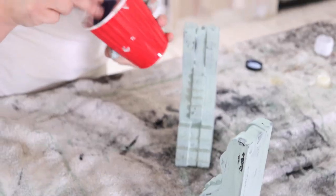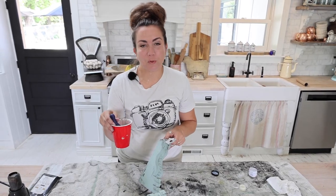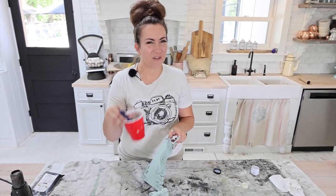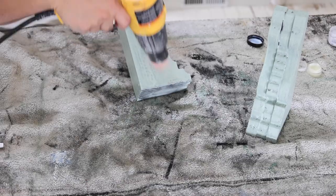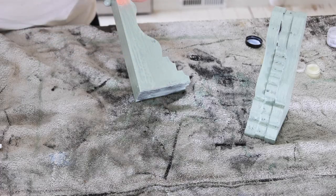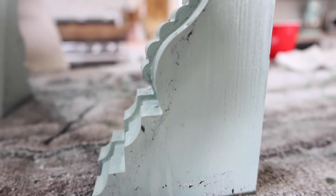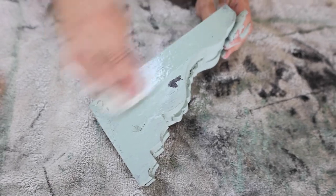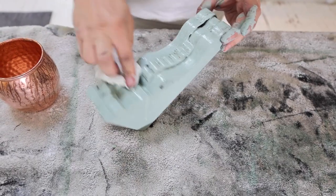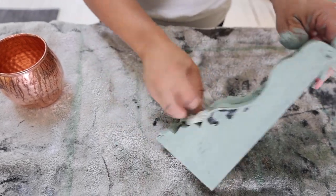I've got it mostly dry so I'm going to use the little bit of milk paint I have left to do one more coat. You can even add just a little dab of water to stretch out that last coat, because water helps reactivate the paint and make it chippy — don't worry if you have to water down that last dab of milk paint. You can also paint the bottom if you want. You can see it's already starting to chip; I'm going to wet distress it. You can use sandpaper, but the water helps give you more chippy crackle, and then I'll come one last time with a heat gun.